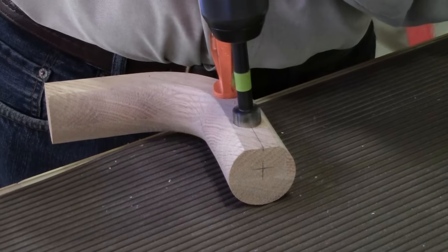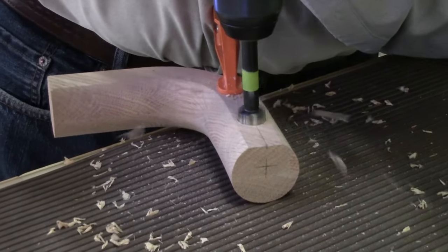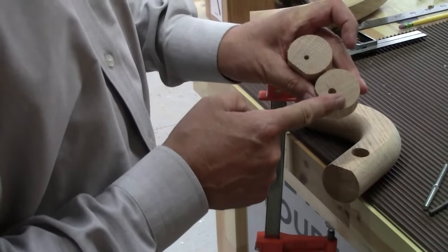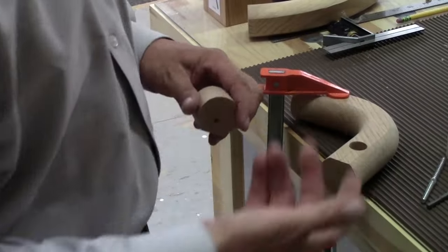I'm going to drill a hole into the rail — that three-quarter inch hole that holds the micro head. After the hole is done, I cut two pieces of wafer from the rail or fitting and drilled one five-sixteenths and one three-sixteenths clearance hole. I'm going to use that as a guide when drilling to help keep the perpendicular hole into the rail nice and straight.